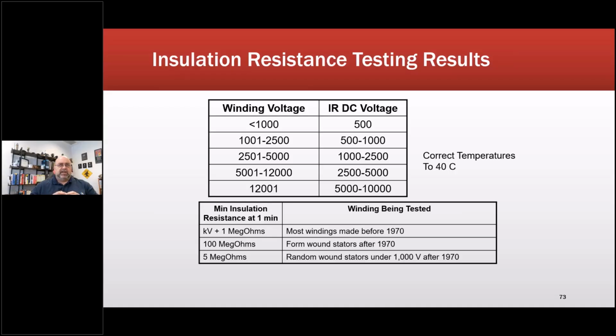And we did a study in 2019, so I think I actually published it in 2020. We took the air pressure and brought it down to 0.08 millimeters of mercury, or inches of mercury, whatever it was. It was almost pure vacuum. And of course, when I have still some material there, that means my insulation resistance dropped significantly. So air pressure most definitely has an impact.